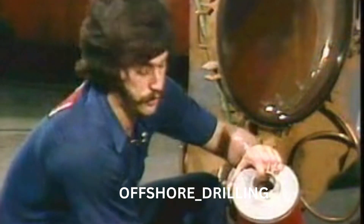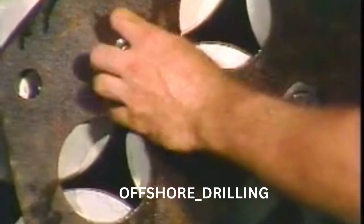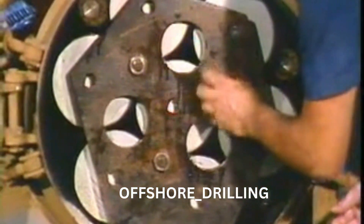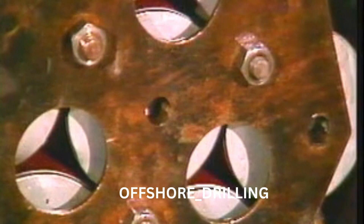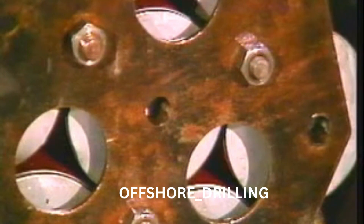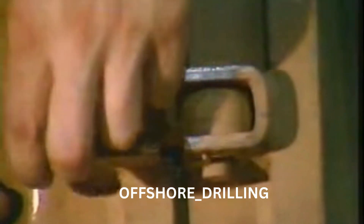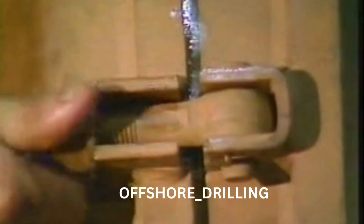On the back of these, you have a plate that supports all seven of these filters. If you install it incorrectly, the weight of the plate will push every one of the filters down, which will make a leakage around this rubber gasket right here. With that done, you're ready to check the condition of the cover gasket. Use a new one if you have any doubts — a light film of petroleum grease helps hold the gasket in place. Close the cover and tighten the bolts, then close off the filter drain valve.